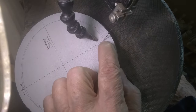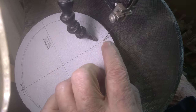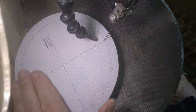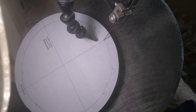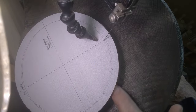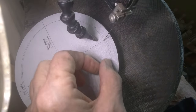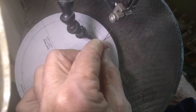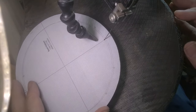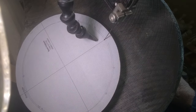I've got an entry hole drilled here at 35 degrees. We're going to cut the inner part of this ring at 35. Then we're going to set this on top of the base - since we cut the edge off the outside of it, it's not going to match up with the outside, it's going to be slightly in. We'll mark that and then cut that as an outside cut at 45 degrees. So for now, let me cut this ring out at 35 degrees, and that will be the last ring - all we'll have to do is modify the base.